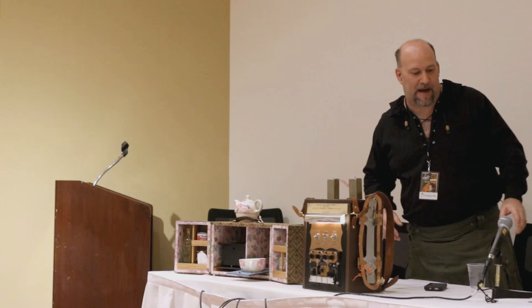Materials. I use plywood. I like it as long as you don't go into the side of it — it holds fasteners pretty well. If you go into the side, pre-drill your hole, put glue on the fastener, then drive it in. Just like particleboard — who here has bought furniture from IKEA and taken it apart twice? Then it doesn't go back together anymore. Same thing with the edge of plywood — you've got about two times. Dry fit your stuff first, make the hole, put the screw in, then take it out. The next time the screw goes in should be for your final assembly.